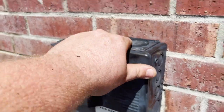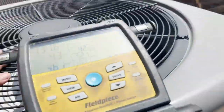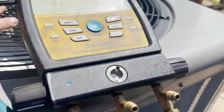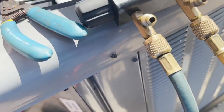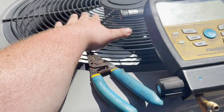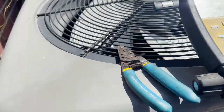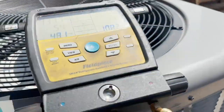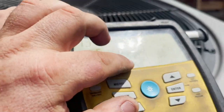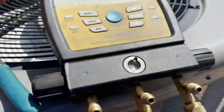We got the box secured to the wall. When I got back, the unit had shut down — it's got a Nest thermostat and it was in time delay. I don't know why or if someone was adjusting it, but it's gotten even hotter in the space. If you look here, we've dropped the superheat and we've dropped the suction line temperature. The subcooling is still fluctuating, so I'm not going to add any more refrigerant.